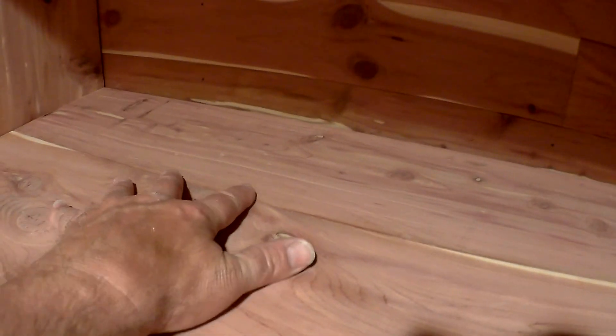Even this outside corner — I routered all four sides and then mitered the inside to make my own outside corner. He has this long bar for his coats. For the shelves, same thing — they're all biscuit jointed together because anything over eight inches of cedar wants to cup. So I ripped everything down, biscuit jointed them, ran them through my planer, then routed everything. Everything was handmade with stainless steel screws in the shelving.